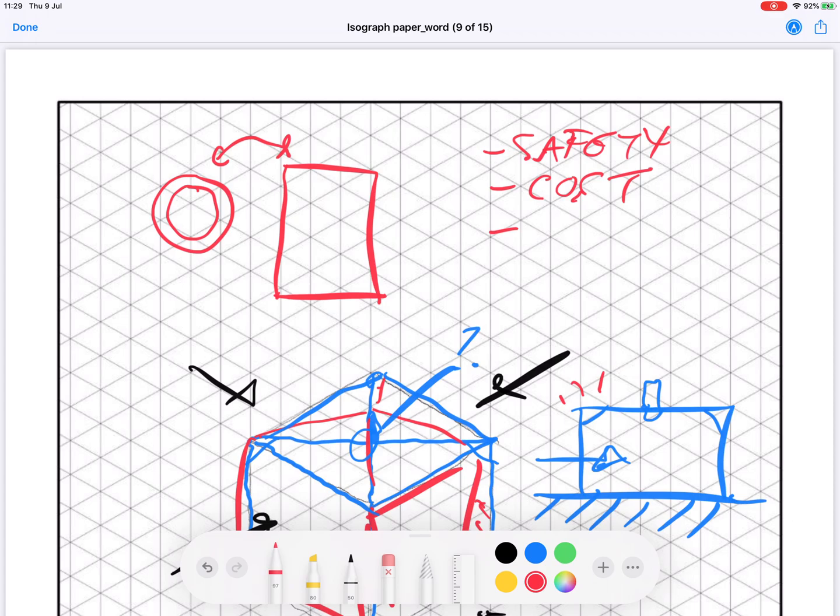Now, you've used timber as your gazebo structure, and most gazebos you purchase from, say, DIY shops like Homebase or B&Q are very lightweight structures, made from tubular steel with plastic inserts or brackets. I think the first thing you want to consider is that the timber you're using has the same structural equivalency as a steel tube. Obviously, the steel tubes you see in gazebos are very thin, very small, very light, in comparison to the timber you'll be using.